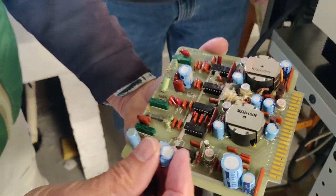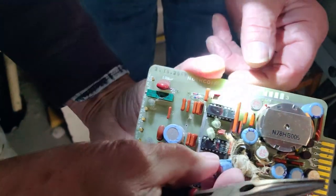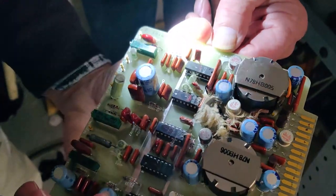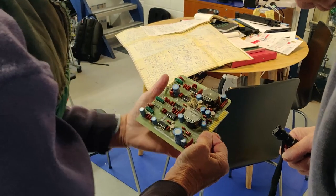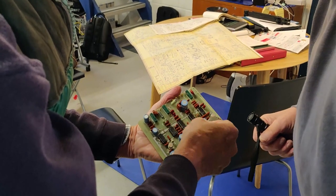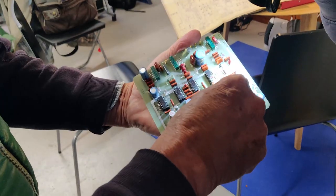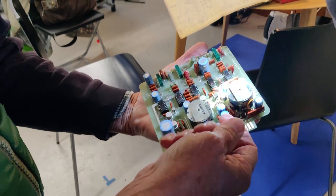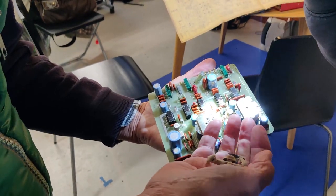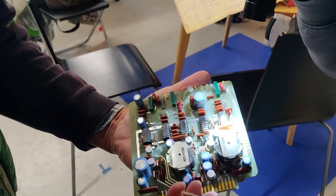Good news. So what's just happened there? This just fell out as I... Yeah, I think it's the top of the capacitor that fell off. Oh, I'll bet. Is this HC8 the one we're on? Yay! Wonderful, look at that. I wondered if it might be a cap. I've never seen one like this. Is the electrolyte dried out then? It's probably depolarised and then just gone short circuit. Yeah, bang. Wow, well, wash your hands before you have a cookie. Pop that in the bin, I guess.